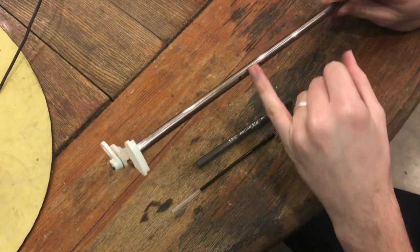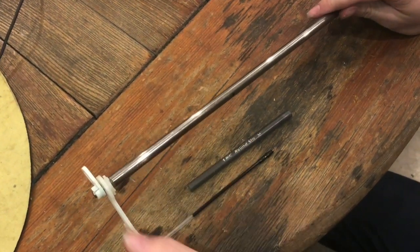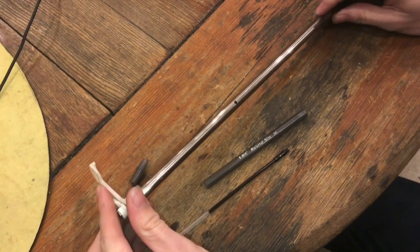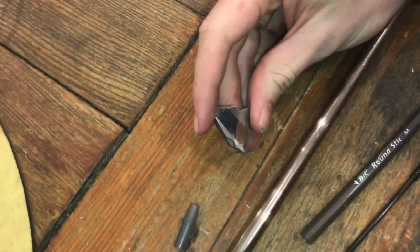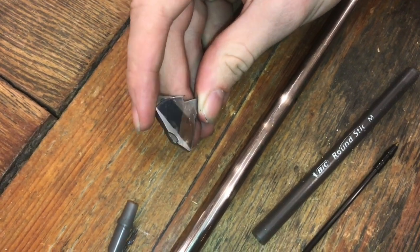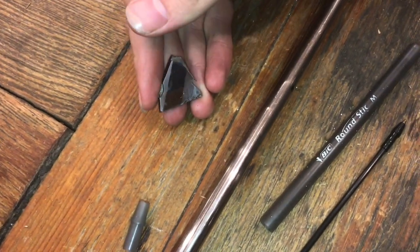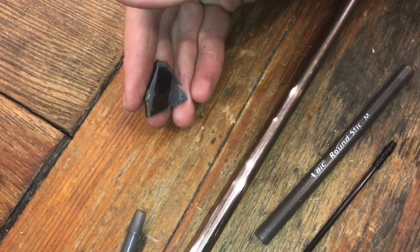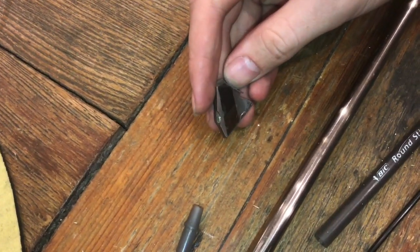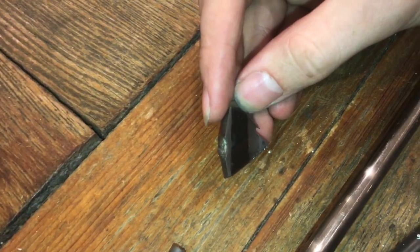First I'm going to cut off the section I'll be using for the casing, face both ends, do some drilling, and I think I'm going to add a flat spot on the mill. When it's all finished, I'm going to blue it. I have a sample I've been doing some testing with — this is just a piece of mild steel. You can see there's a blue section and a gold section, and then just the plain polished steel finish. That's all done with heat — it's an oxide layer on the outside. I can put many different colors onto the same surface, and I can control where the colors go with just vinyl cutting and vinegar.